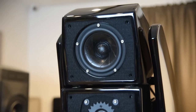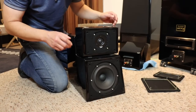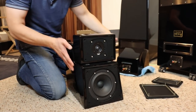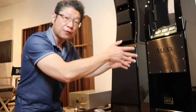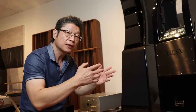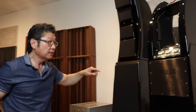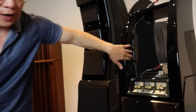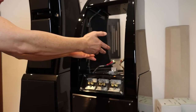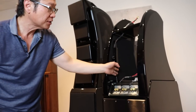You can see there are two separate modules — the tweeter module and the lower midrange module. When you install it, you put this entire assembly — it's all one — through the front of the speaker. You need two people: one feeds the module from the front and the other person in the back guides it through the wings very gently, so you don't damage the finish.